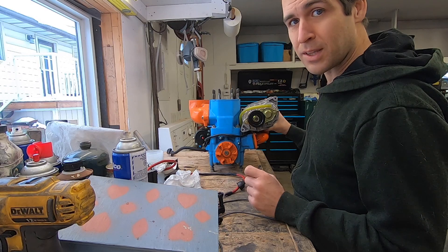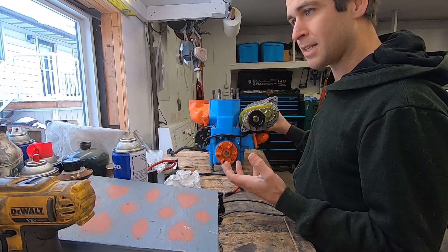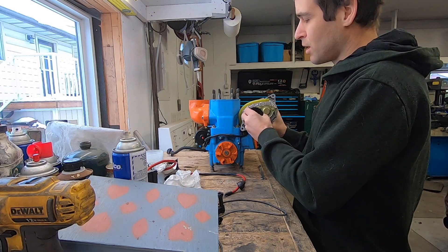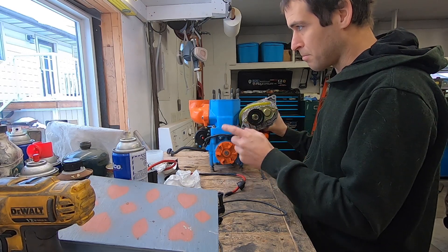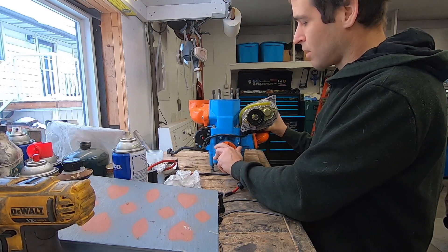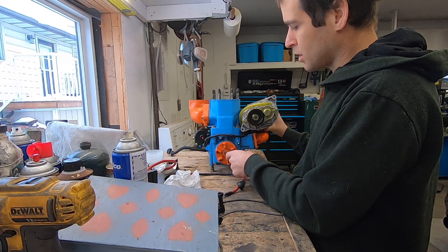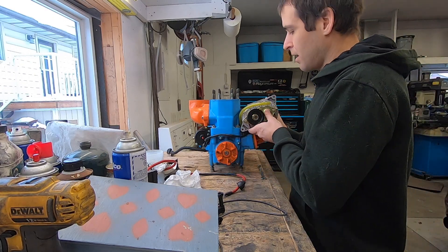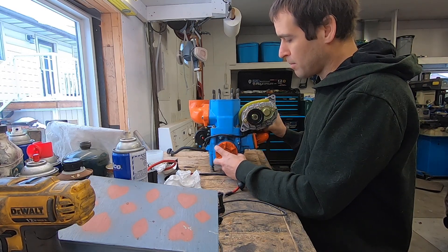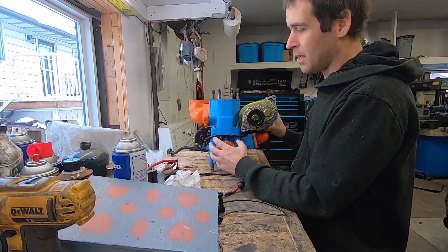A couple of videos back during the unboxing of the 1100 Kawasaki from the Jet Ski Brothers, I held a broken coupler and said I might use it in an upcoming project — that project was this. I was thinking about using the broken coupler to make a coupler that also had a pulley built onto it. So instead of ruining this one trying to figure that out, I'll use the other one, though the thread pattern here might actually be different. I'll probably need to get a big chunk of aluminum or cast a piece to make the coupler into a drive pulley on the outside.